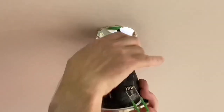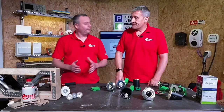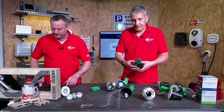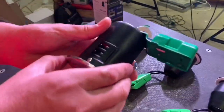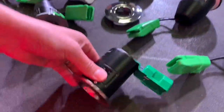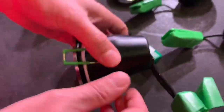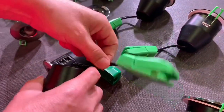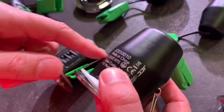The new can has a very slim tapered design at the back which makes it easier to push through the hole in the plasterboard. Comparing it to the original design — which had a solid cylinder with the connection fixed directly to the can — the new version has the connection loose on a nicely over-sheathed cable for additional protection. And that's the tapered design.